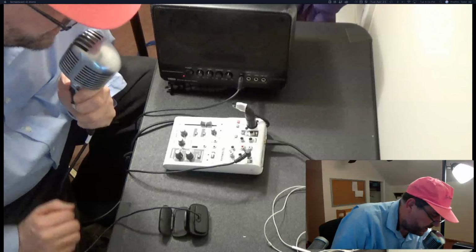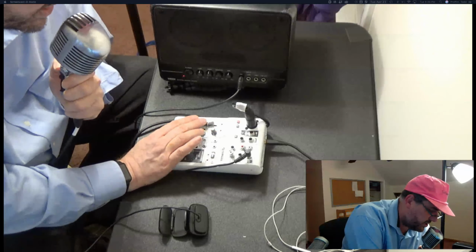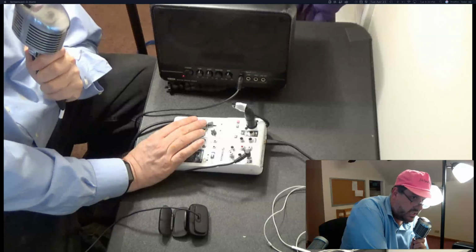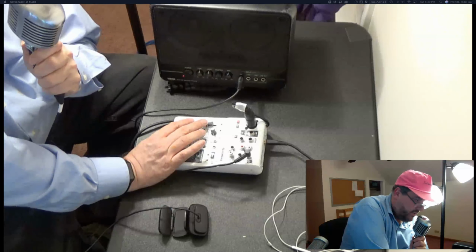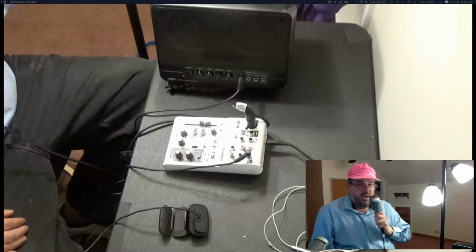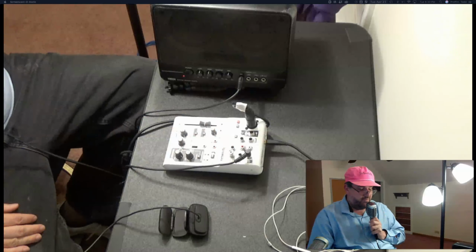Check, 1, 2, check. Let me turn the gain up a little bit. You'll hear a little more, and it's going to start to ring. That ringing you're hearing is feedback. That means the microphone's picking up the speaker, and it's looping back. This can be very dangerous, so you don't want to ever put your microphone in front of the speaker. Now I'm going to pull back just a little bit and turn down a little bit, and that'll help. You can do things like EQ the feedback out if you need to.